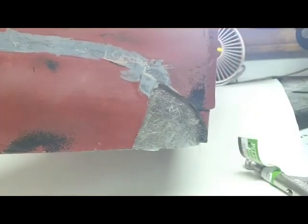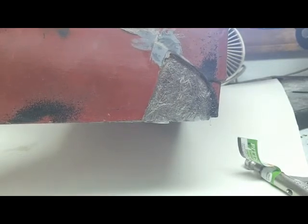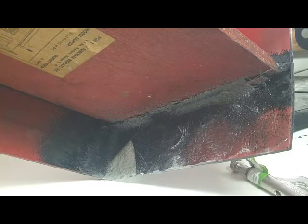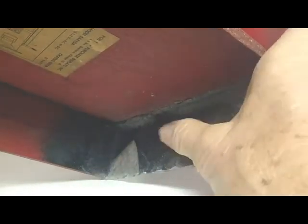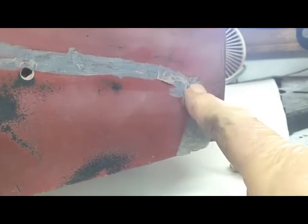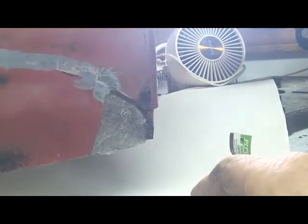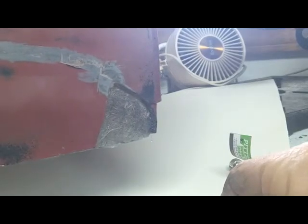The fiberglassing is done. You can see here on this corner the fiberglass on the back side. That'll hold the body putty that I'm going to fill in that big hole with. Look on the inside, you can see how I went all the way across there. That'll help reinforce that joint of that piece that was broken off. And this is real tough stuff. I mean, that's hard, rock hard, and should last a long time. And you can see the joint here where I put this piece on with JB Weld. So I'm going to start the body putty in this place, and after that's hardened, we got a lot of sanding and shaping to do. But I'm pleased so far. It looks real good and looks real sturdy.